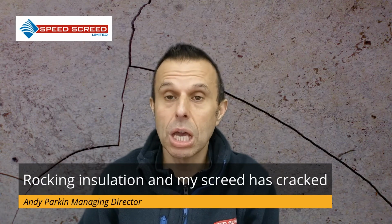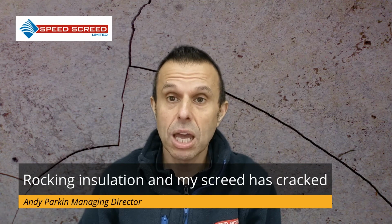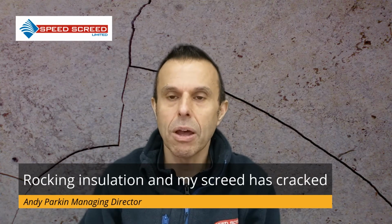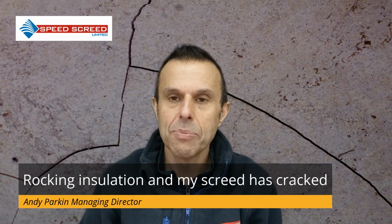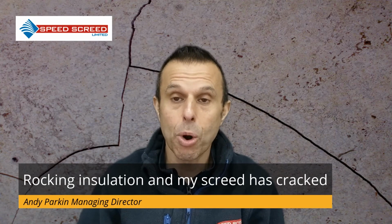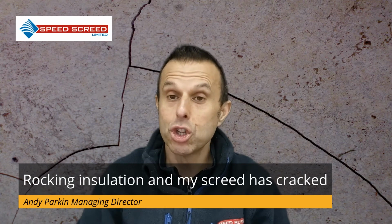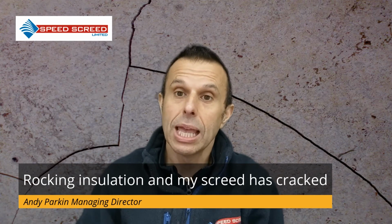It sounds like a classic case where the substrate's not right and the insulation isn't right, and it could well be that it needs pulling out and addressing, rather than sticking a sticky plaster over it and solving it for a short while until it fails again. There are some repair solutions, but when it's the substrate that's the actual problem, I'm sure the screed is probably absolutely fine. It's the substrate that is the problem.